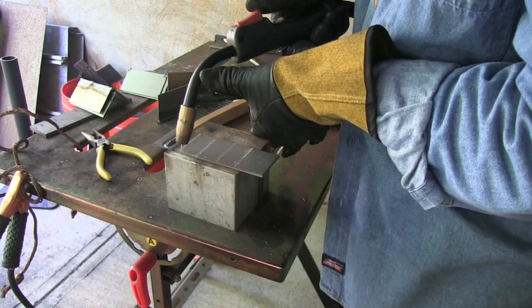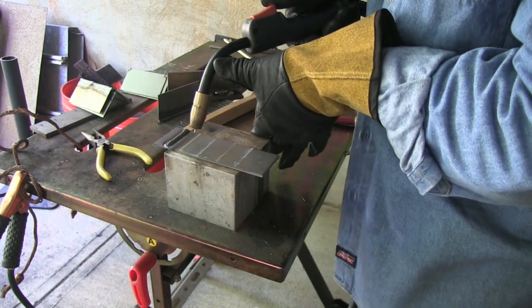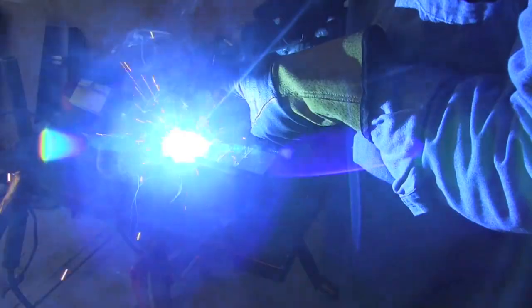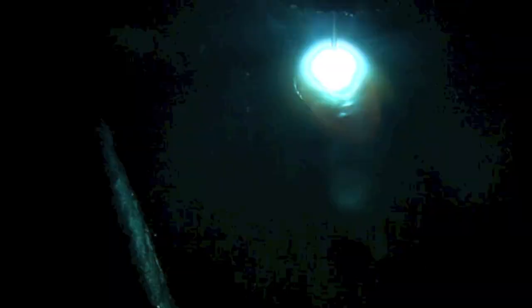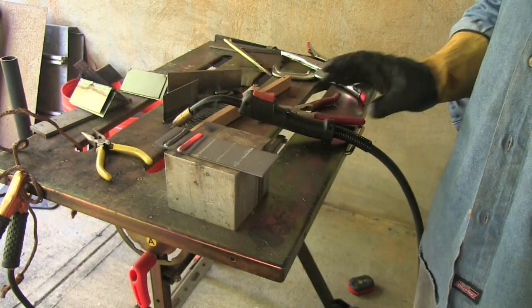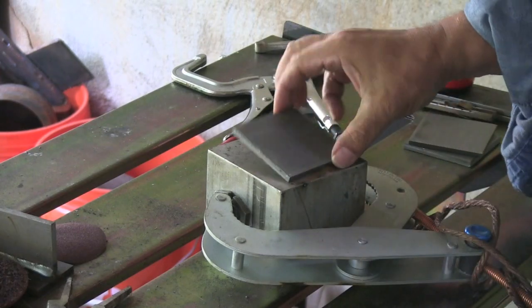We'll run another one, prop again, take a few dry runs. I've got it set on a big aluminum block — that helps a lot pulling heat out of the piece so you can just keep welding. Otherwise you'd have to quench it in a bucket of water every four or five beads or things get unmanageable. Just running beads — doesn't have to be that long when you're first starting. Just run beads until you feel really comfortable with it.